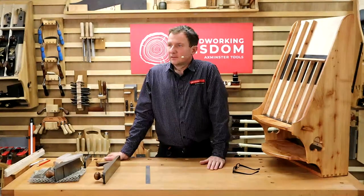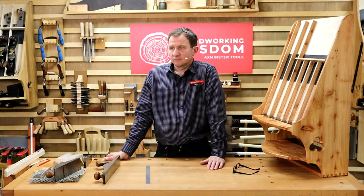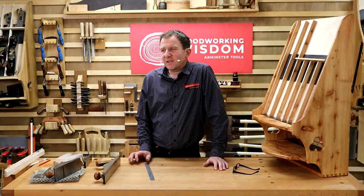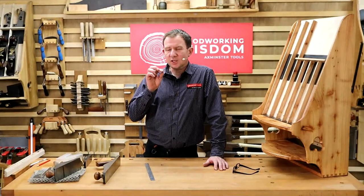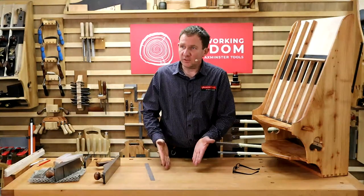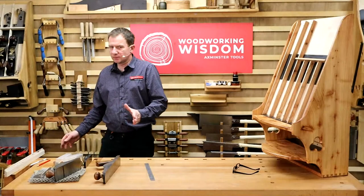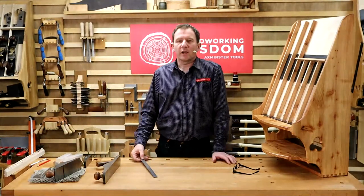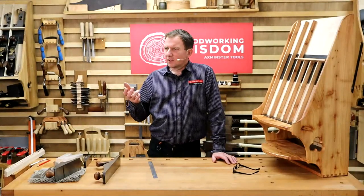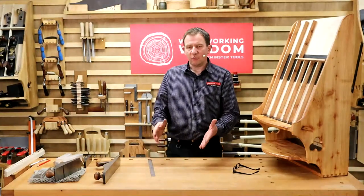Craig notes: we ended up with about 45mm strips with about 80mm spacing in between — gives them all such versatility. Quick question: if you've not got a table saw, what about a bandsaw? Feed slowly, make sure your guides are nice and low as close as you can get to that board to keep your accuracy. You could even use a hand circular saw with a 45-degree tilt and your fence. You could get away with your bandsaw with a nice sharp blade — our premium bi-metal blade is really good, definitely for the plywood. It'll keep it nice and straight.